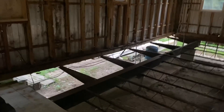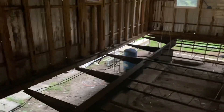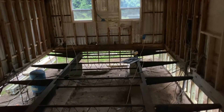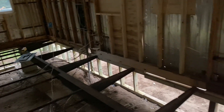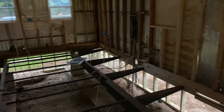Once the shoring is complete on the west side, which we have yet to do, from the inside you can see what we have done and how we lined up our studs with the studs in the trailer. That gives it added support. We're going to continue and redo what they did to make it all consistent with what we did yesterday. Pretty exciting!